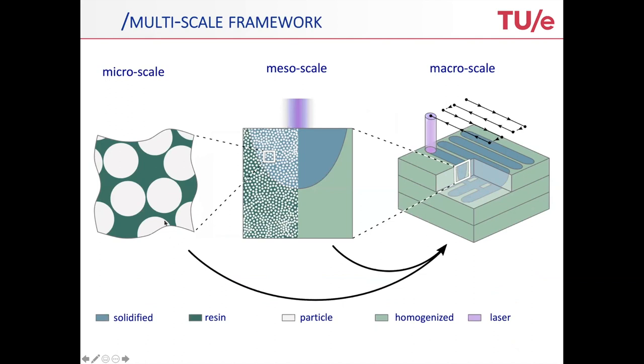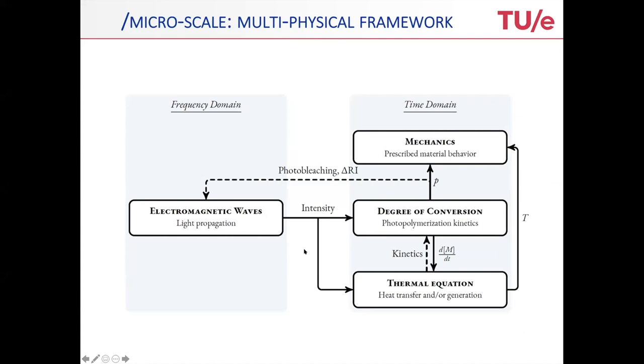So let's look at the scale transition. We actually deal with two scale transitions. One is what we call the micro-macro — jumping immediately from the microscopic to the macroscopic scale. And we have a second scale transition where we really need to go to the level of the particles at the slurry level, where we need to solve the scattering problem and deal with what kind of intensity profiles are really visible when you want to print at the macroscopic scale. Since scattering is important, you need to know what kind of profiles you have — it depends on the particles, the particle size, and distributions. You need to solve the light propagation problem by solving Maxwell's equations.